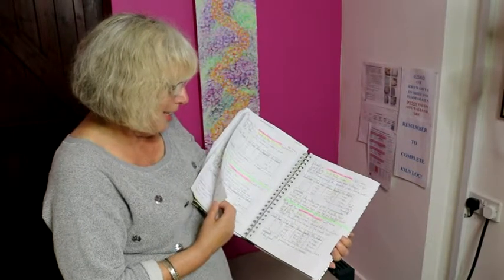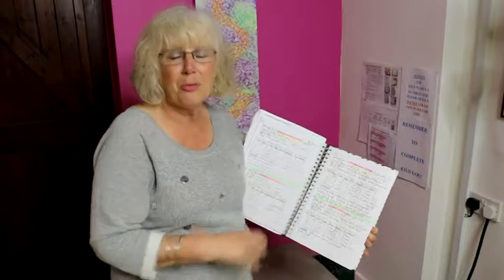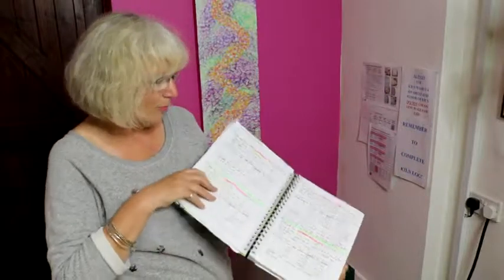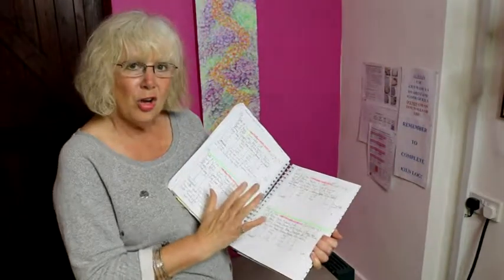The other thing is that sometimes when you do a piece, you may use the auto program, say on auto fast tack, and not like the results. So if you've got it in your log and you've logged the result and what you didn't like about it, again, you can then go in and program a program to do what you want and experiment with the temperatures. So I highly recommend that you keep a kiln log for every time that you do a firing with your kiln. As I said, this is a brief overview.